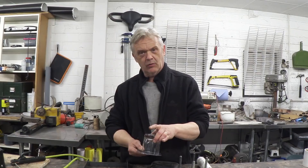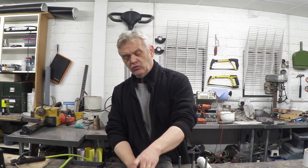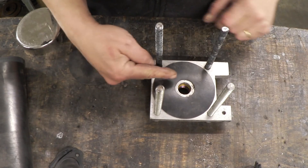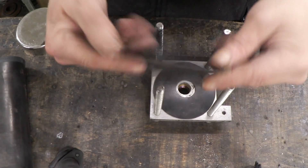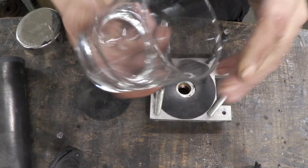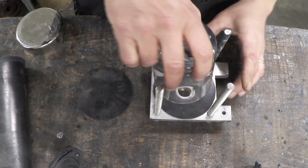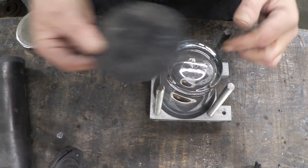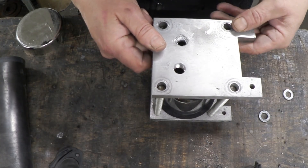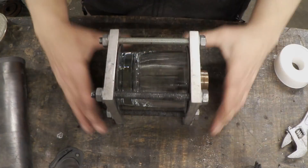On something like this I quite like sheet materials — either a rubber that'll cope with the temperature or a bit of graphite foil. All you really do is lay the thing on what you want to make a seal with, cut out the circle, pop the two together, and bolt the whole thing down. We're going to do it with rubber. I'm going to cut out two circles to go around that glass, one with a large hole in it. So with the trap seal I've cut two discs of high temperature rubber — one with the inlet hole from the cyclone, and a flat one for the bottom so we're giving the glass a little bit of give on either side. An ordinary highball glass goes on there, then the disc, then the top plate, which we bolt down to clamp everything in place.